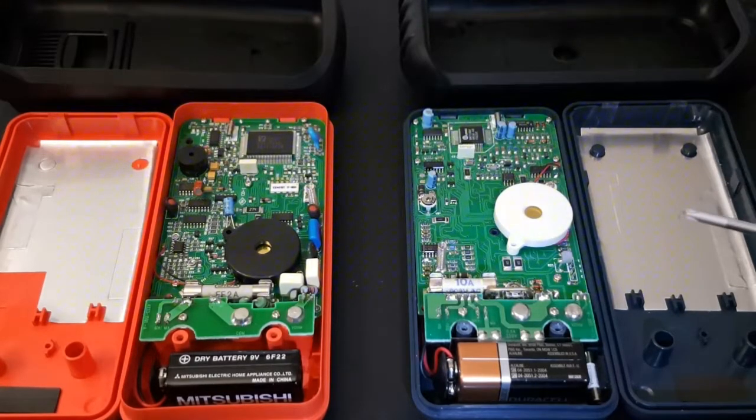A lot of digital multimeters today, even expensive ones, have no shielding. And for the life of me, I just don't understand why this is. These are electronic instruments, precision instruments at that, and really, RF interference can negate or change readings. So this should be standard on any multimeter. I don't know exactly how the standards are written, but I'll definitely have to look at that one day because it's nice to see, and this is the way it should be.